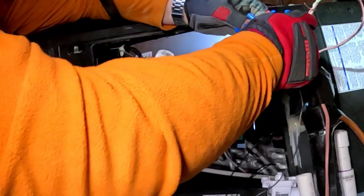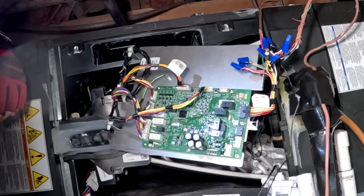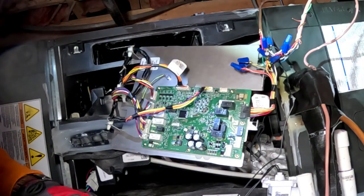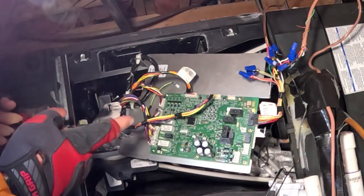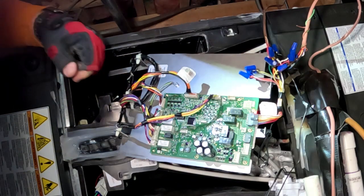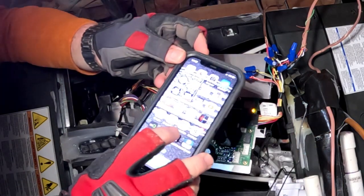What I'm going to do is disconnect the 24 volts from the thermostat because I don't want this thing to come on while I'm doing this setup. I'm just going to disconnect that temporarily — basically disconnecting the float switch — then put the disconnect back in. That's the stepper motor going through a set and reset process; it'll do that every time you power off and power on.